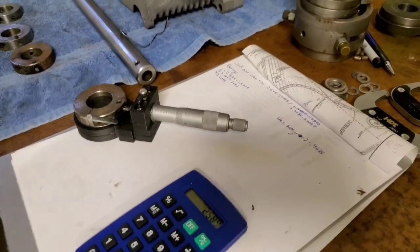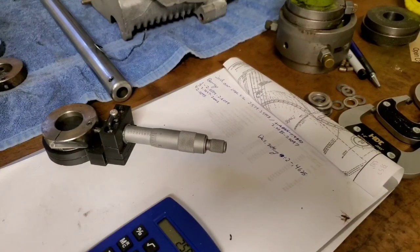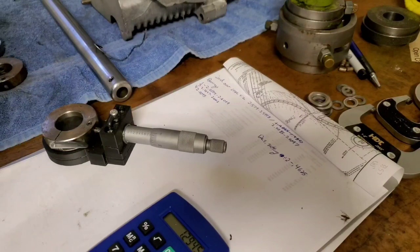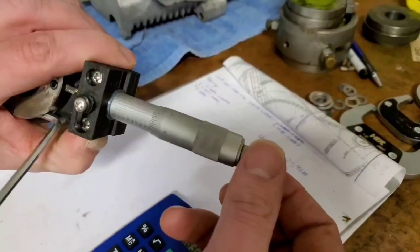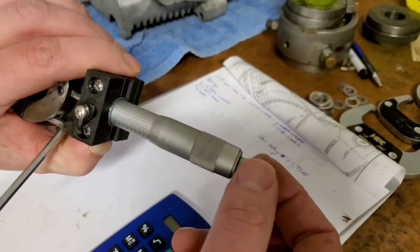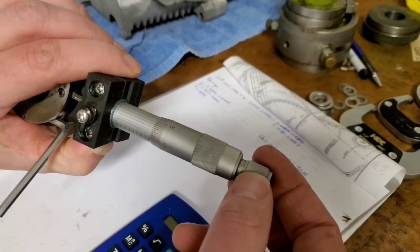With a little bit of trial and error I found with my micrometer, I'm going to divide that by 2. That comes out to 1.2945. Then I will subtract 0.4625. That comes out with 832 thousandths. So on the micrometer here, there's 825, 830, 832.